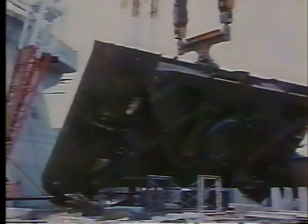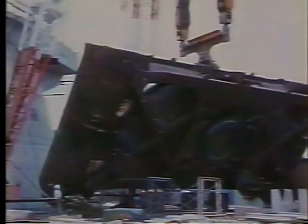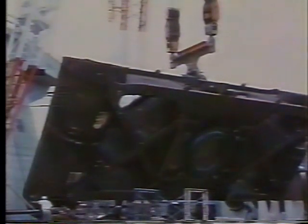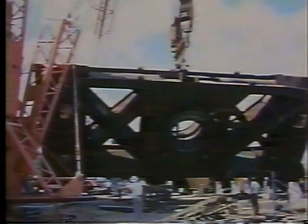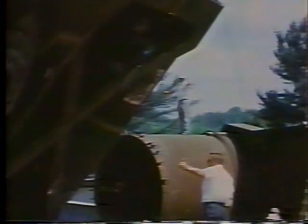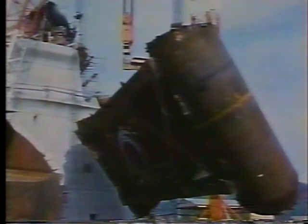This was the first of the 4 sub-assemblies which in the air will become the yoke. The first to go up is the centerpiece which will fit on the sphere. Other sub-assemblies have been moved back and the center, with hub, is raised off the ground. Here again, the angle of the piece is all important. It must hang so that the hub is at the angle of the sphere to which it will bolt in the same way that the sphere bolted to the shaft.